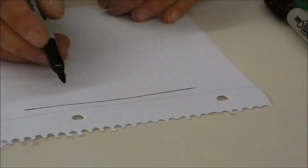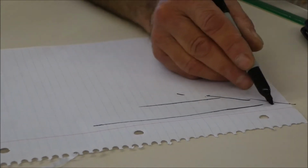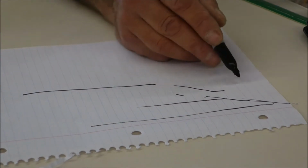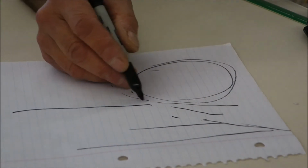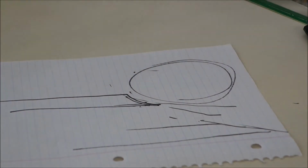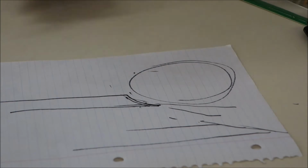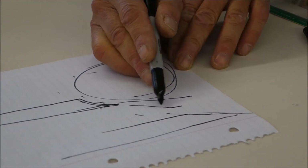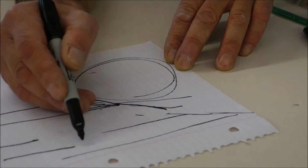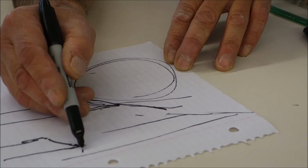You like that. With chisels or plane blades, if you're looking at the cross section, you know you've got an angle like this. With a chisel, you're grinding it first against a grinding wheel, right? Since you're putting it against the grinding wheel, I'm exaggerating, you get this hollow ground. When you hold a chisel on a grinding wheel, you get a hollow grind like this. And then you move it to a stone where you hand sharpen it, where you hone it, and the stone gives you these two flats. So the sharp blade in the end looks like this, and then it's hollow ground like this. So you're just maintaining this sharp edge here, right?